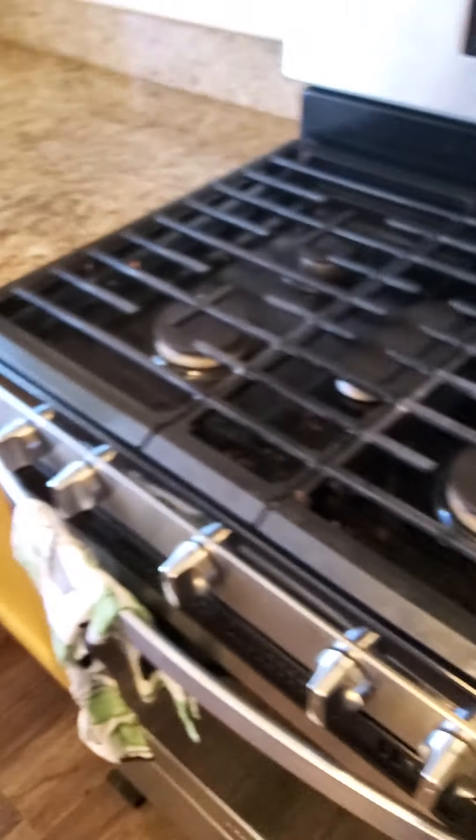I'll have to look through the photos for the foundation, but I did not see any concerns with structural movement. I did run all the burners — you'll see the photos. These squeaks you can hear right here — a lot of times they didn't use subfloor glue back then. They didn't start using a lot of subfloor glue until around the mid-90s.